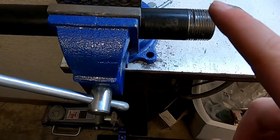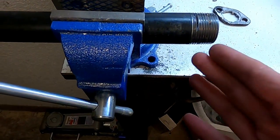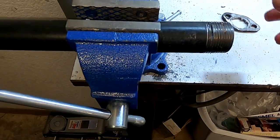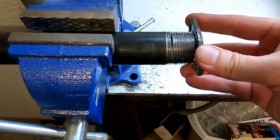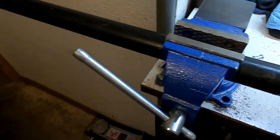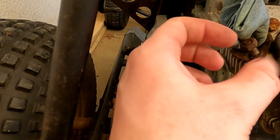Let me get the head changed on the grinder back to the cutoff wheel. We're going to cut this off real quick and try to grind a little bit of an angle on it so it will come out off the flange at a slight angle. Basically instead of it being flat, we want it to kind of tip out a little bit. Because when it's mounted on here, the flange is directional, so we can't just stick it on there.